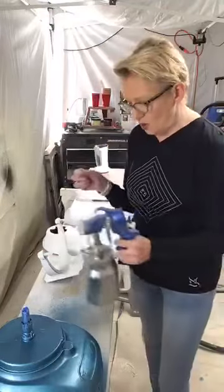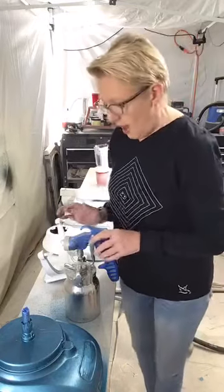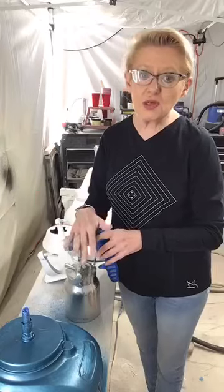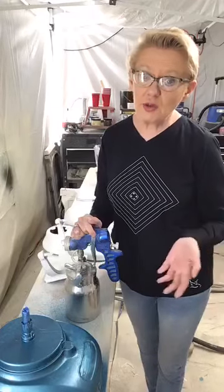So with the Moonshine Metallics, you do need to thin it a little bit. Go according to the instructions with your sprayer. If you have a viscosity cup, which I think the majority of sprayers come with, use your viscosity cup until you're really, really sure of yourself. Before you ask, I'm using an Earlex 5500 spray station today. I also have a couple of Home Right Finish Max in the back that I use, and the Wagner sprayers are great to use with the metallics also.